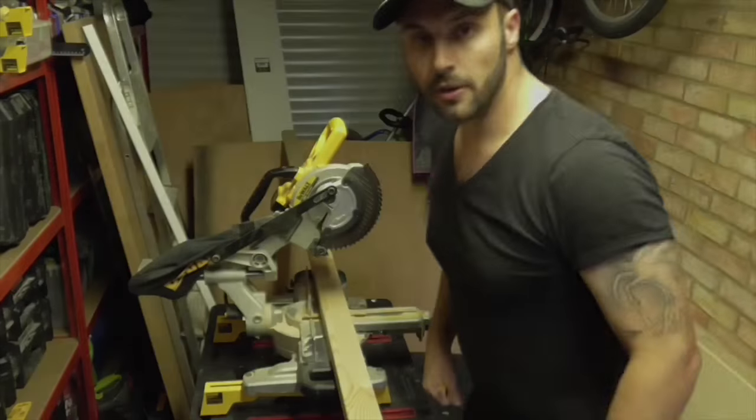There's plenty of room between the worktop and the wall — the bow in the wall doesn't appear to be an issue. The idea is it's going to fold down like this and I'll have a nice big worktop to work from. I've got the new worktop laid out on the little work table. What I'm going to do now — as a lot of other people that have built these on YouTube do — is build a frame around the MDF because MDF is quite flimsy and only 15mm thick, so it's going to flex. I'll probably put some cross members in as well, maybe at 45 degrees, because as they teach you at school a triangle is stronger than a square. I've got my miter saw so I can cut perfect 45-degree miters. I've mitered both ends of the skirts.